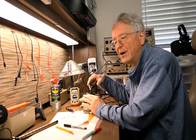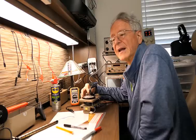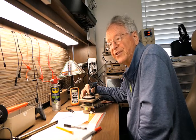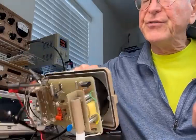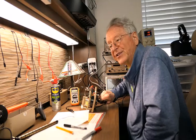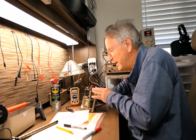So the only thing that was left was the response potentiometer. I determined that it had failed and was open. Since the original potentiometer is hard to come by, I bypassed it with a 5K resistor, and now the meter works perfectly. I was then able to calibrate each range to complete the task, bringing this meter back to life.